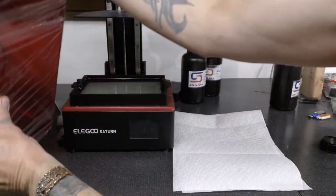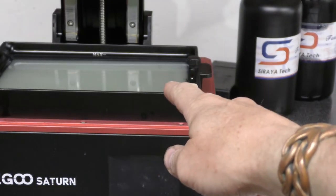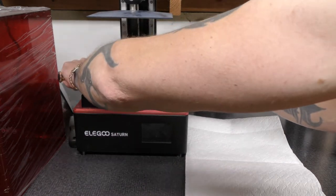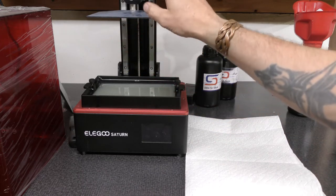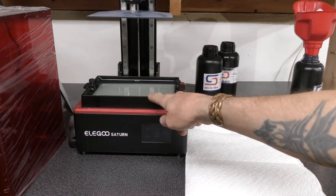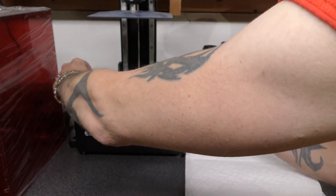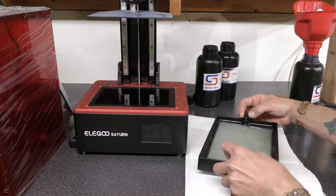Let's take the top off. You can see the resin — it's kind of a greenish, very translucent look. That's a great indicator that you need to mix your resin up. Make sure it's clean and there are no 3D-printed parts in it. If there was a part, I would remove the build plate before removing this. Since it's clean I don't need to worry about that. Loosen these two screws, lift it straight off, and set it right onto the paper towel.